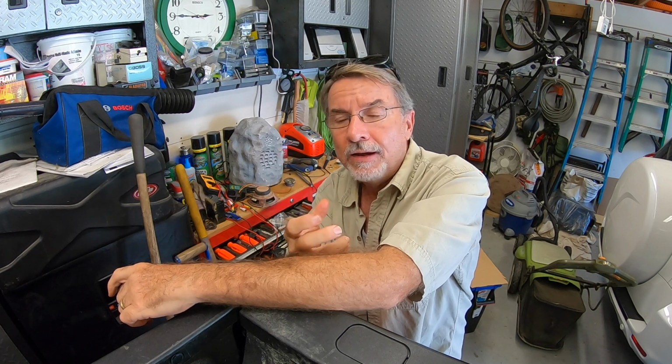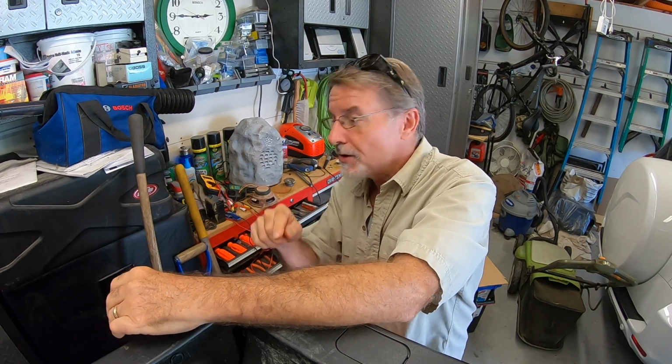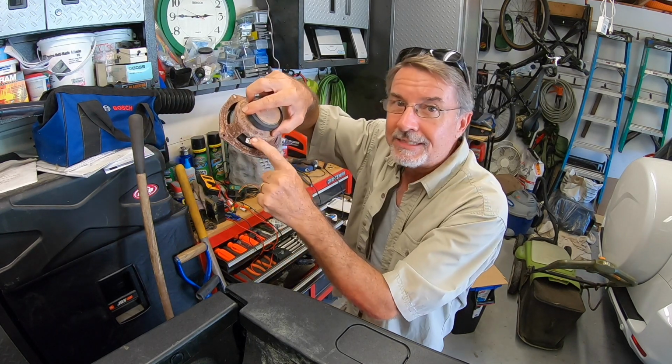Oh, talking about impedance. I said there's basically 3 types of configurations you can have when you're adding speakers onto your system. Say we have an amplifier, and our amplifier is going to connect to multiple speakers in the yard. Normally if you just have 2 speakers, a left channel and a right channel, if you have 8 ohm speakers, it's an 8 ohm load. But maybe you might want to add 2 speakers on the left side and 2 speakers on the right side, like what we want to do out at Villa Feliz. So if you do that, the 3 configurations you can configure it as can be series, parallel, or series parallel. And they all have to do with where you connect the connections on the back, the plus and the negative side of your speakers, and how you connect those speakers together.